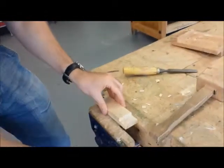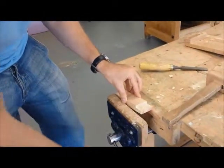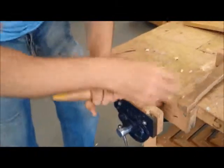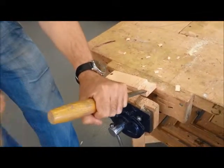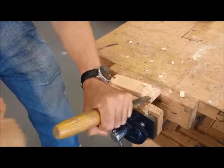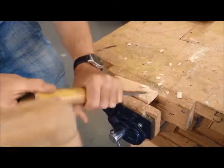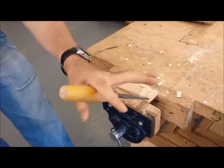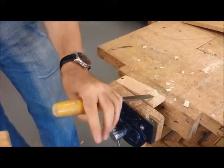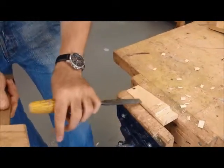Now we turn it around again, and we're going to make that roof shallower. So, with the slope facing down still, change the angle a bit. We're now going to keep going to about halfway, but we're going to attack that wood. You can go almost at this angle. The slope actually pushes that chisel back upwards, and we get to halfway, we stop.